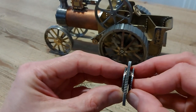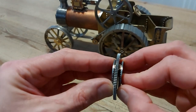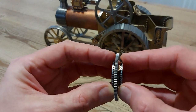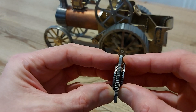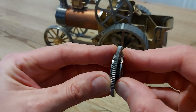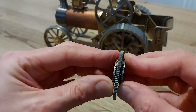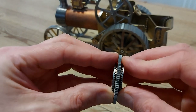And what we see then is a motion — you can just see this working now. The relative movement of these two crown wheels to each other rotates and allows those pinions to rotate, which allows those crown wheels to rotate opposite to each other. So we can drive it, but also we can allow for relative movement.